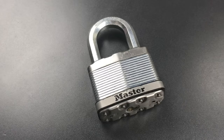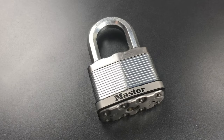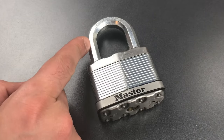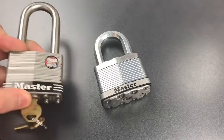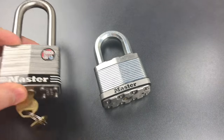This is the Lockpicking Lawyer, and what I have for you today is a product from Master Lock's Magnum series, the M15 padlock. Now, this is a lock of extremes. On one hand, it has a beefy 2.5-inch wide laminated steel lock body and a very high quality 11mm boron alloy shackle. That shackle is held in place with a ball bearing locking mechanism, which is a vast improvement over the previous Model 15, which by the way is still sold by Master Lock.